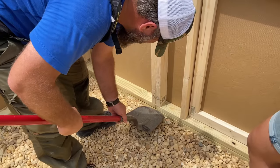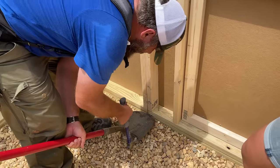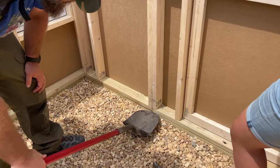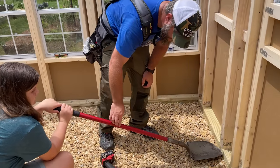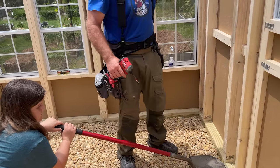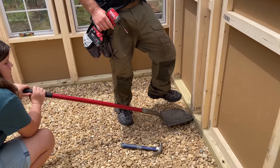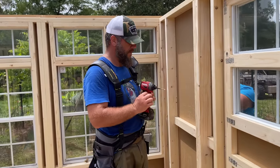No, Adam, I'm not going to cut it out of the video, because this is a good opportunity to show you that when you run into situations where your two pieces don't come flush at the top, work from opposite corners. In the last piece that you saw, I shoved the one corner over, screwed that down, and then I was able to screw the other end down, which tightened everything up. Super easy to fix. If you have an issue, corner to corner.